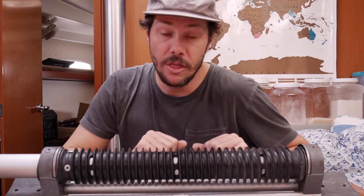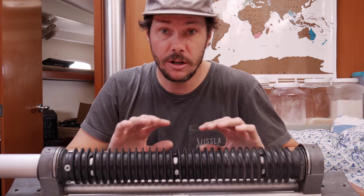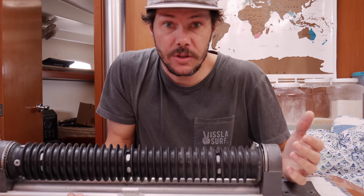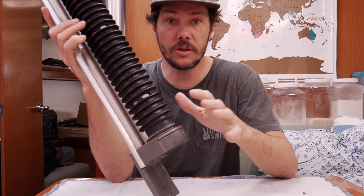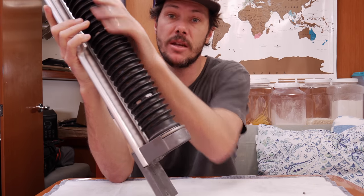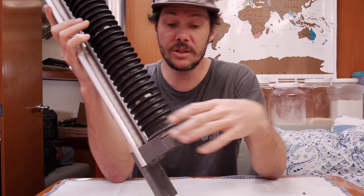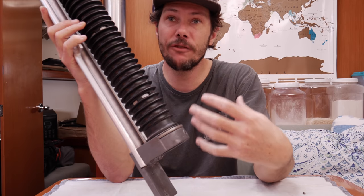So let's talk about what they actually did. I wish I had kept the new screw out long enough to show you. The solution that Z-Spars came up with was essentially just to remove this bottom bearing altogether. And the mechanic explained to me that the vertical tension from the main halyard would negate the reason for even having that bottom bearing.